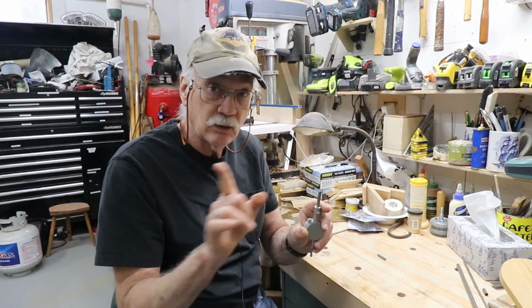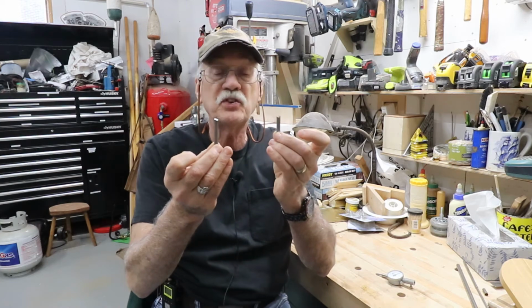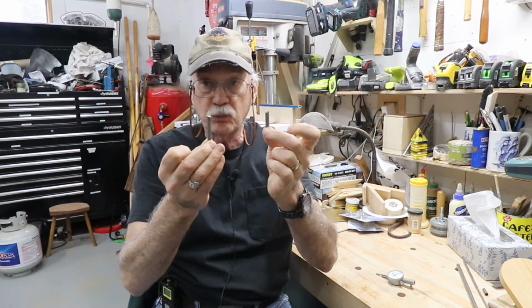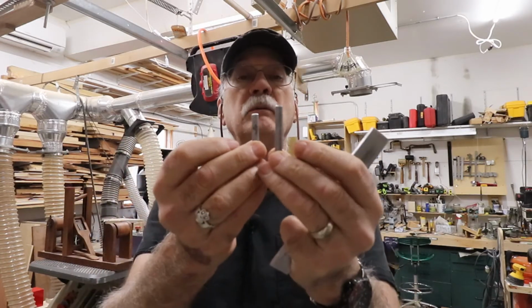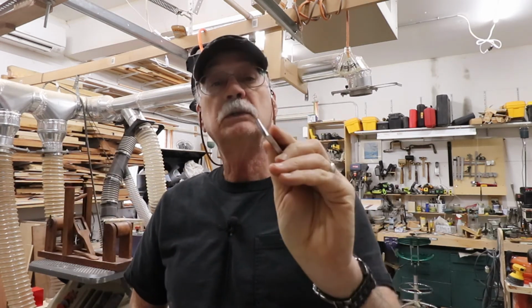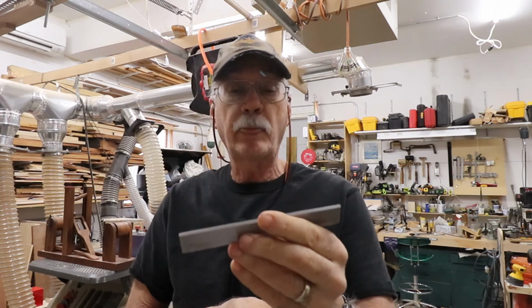The next thing is to make that bracket that goes out 6 inches, and I have two more pieces. I have these 2 pieces of 1/4 inch steel rod, and now what I need to do is weld a piece of flat stock between those two, so that it's rigid, and then I can sweep it around in that 6 inch circle to get the router adjusted. So let's do some welding. So here's my 2 little 1/4 inch rods for the extended bar to put it out 6 inches, and a piece of 3/16 by 3/4 inch bar stock. I'm going to set this up on a piece of metal on the bench here.